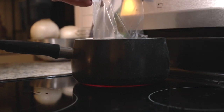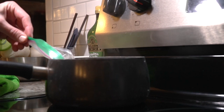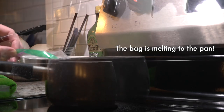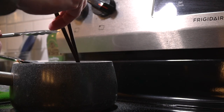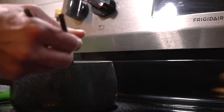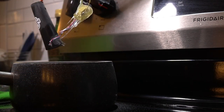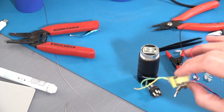I went with the boil in a bag method, quickly giving up on the bag though, and ultimately wielding a set of chopsticks that happened to be close at hand to slowly pull the transformer free, trying not to scald myself on the molten hot glue. It's a pretty big mess when you get all of this out, but the glue does peel away, and I was able to strip most of the excess back with careful tweezering and an X-Acto knife.